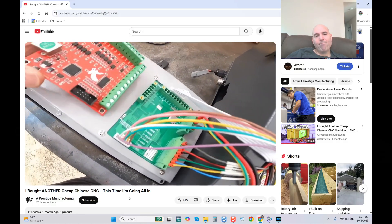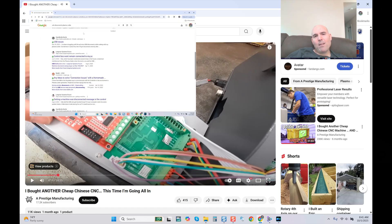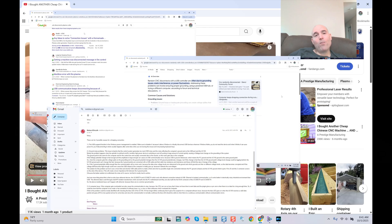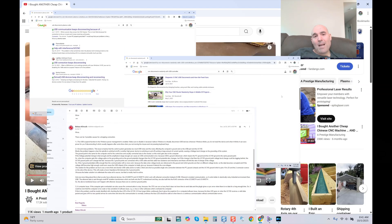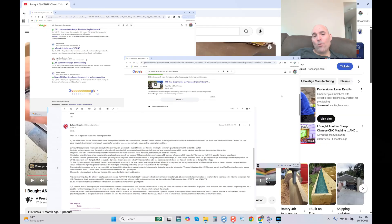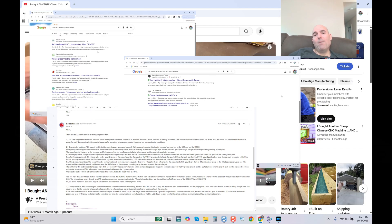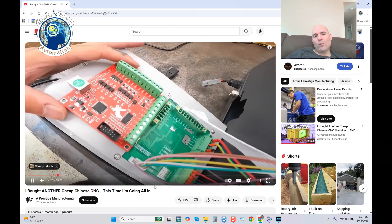You can see this card is almost exactly the same as the card he's planning on swapping out. That is USB — Universal Serial Bus — which once again has no place in CNC, let alone a retrofit on a plasma system, which out of all CNC genres is the most susceptible to EMI. I've said this in tons of videos.